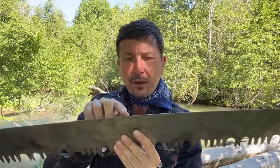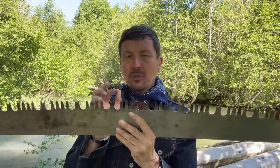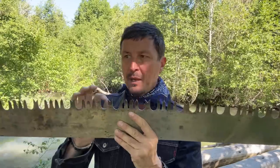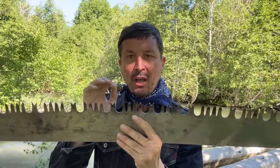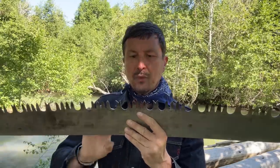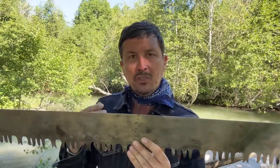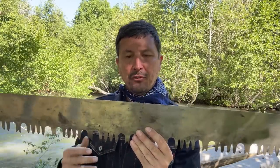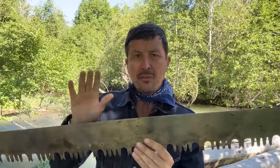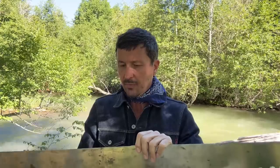When you have a crescent ground saw like this, it's very laser-thin on the back, therefore the kerf can be very small, meaning the set can be very small. So what you have is like a metal laser beam that is cutting a very, very tiny bit of wood, therefore making it a lot easier for the user. You will see modern crosscut saws for sale today, but they're just punched out of band saw stock — they don't have the ability to do that crescent grind, and they really can't be compared.